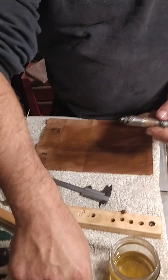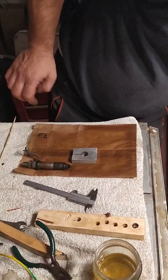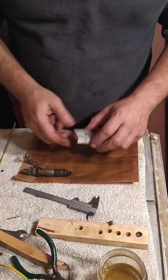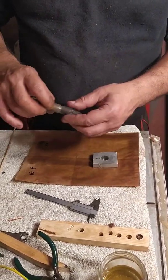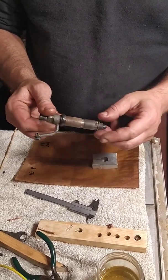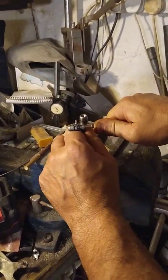Again, using the aluminum clamp part that I've made, I'm going to tighten the whole body. There should be some torque figures. I may write them down in the comments below. Other than that, don't over tighten it, because the threads are very fine and they make a larger force, since this is a fine thread, not a coarse thread. Okay, tighten it up. Okay,